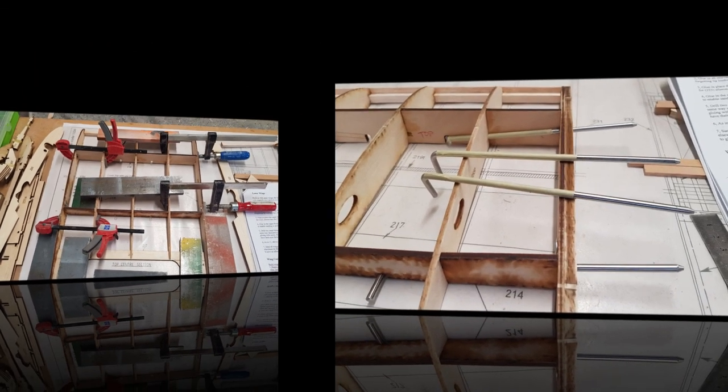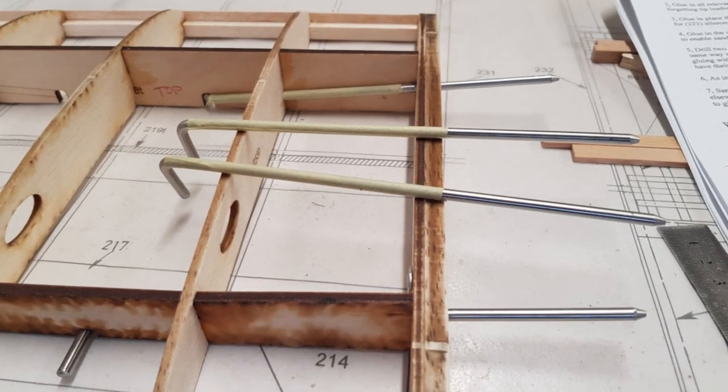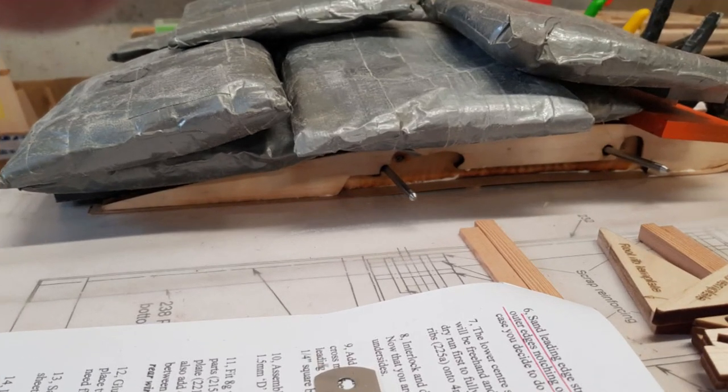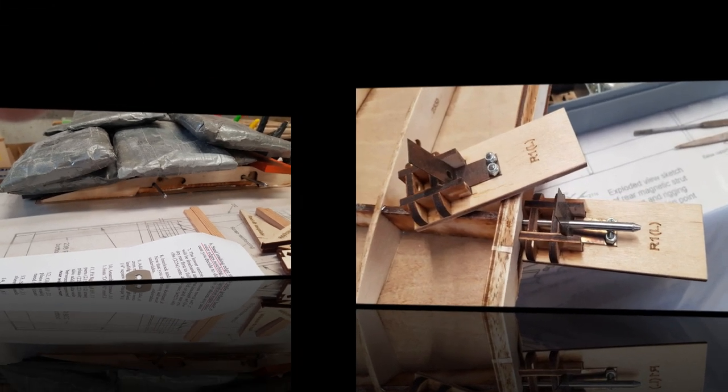Day 5. The wing holding pins are glued onto the center section, but first they are wrapped with painter's tape to make them stick better and not come loose. I then glued a large piece of 0.4mm plywood to the bottom and weighted it down so it would not go anywhere while the glue hardens.